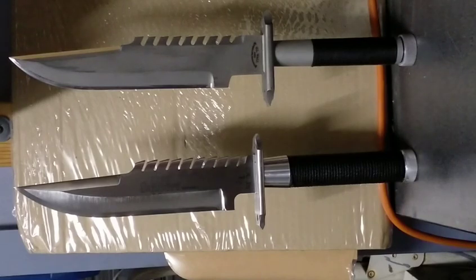For dimensions: I went with a nine-inch blade, which is 228.6mm, by two inches (50.8mm) wide. The Wall knife appears to be a little longer — maybe nine and a half inches — and slightly narrower at 48mm wide. His blade is thicker at about 7.5–7.6mm; mine is 6.5mm. His guard is about 8mm thick; mine is 6mm. In the future I'd like to have the guard cut from the same heat-treated blade material, which would be great.